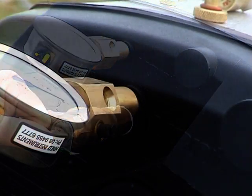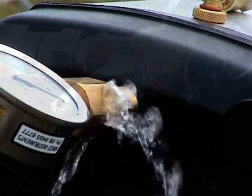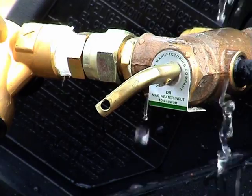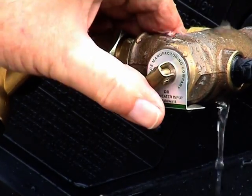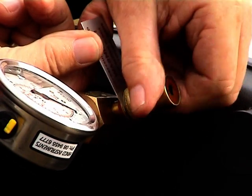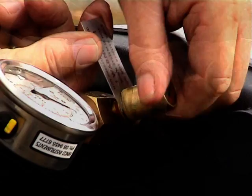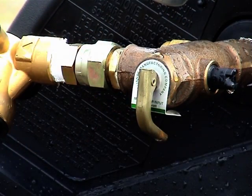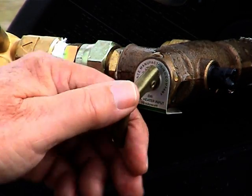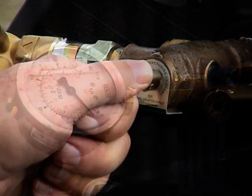The closed circuit is full when water, with air bursts or bubbles, flows from the thumb screw port in the test block assembly. Shut off the HT55 valve. Fit the PR200 valve into the thumb screw port of the test block assembly. Reopen the HT55 valve. This will pressurise the closed circuit.